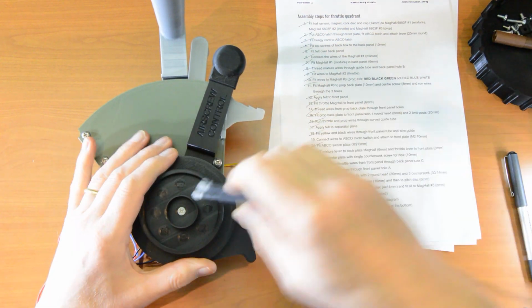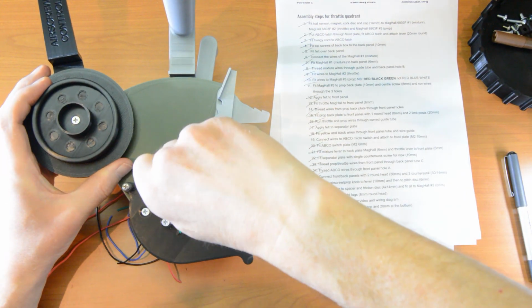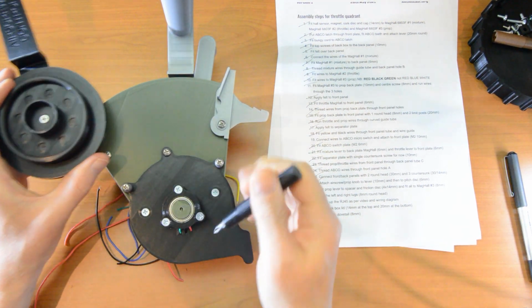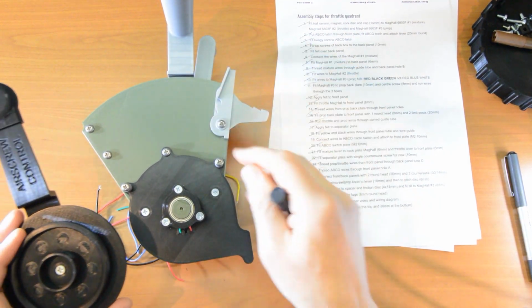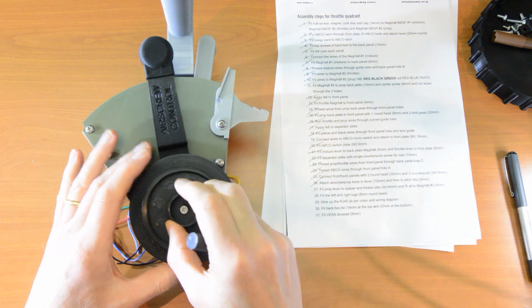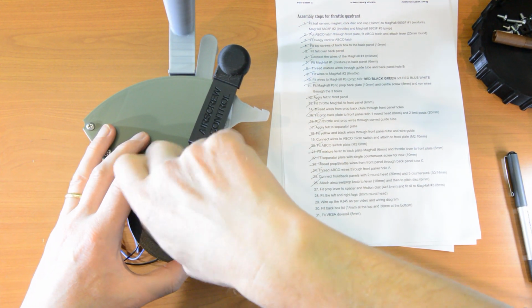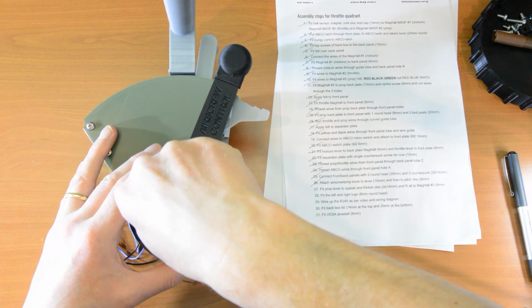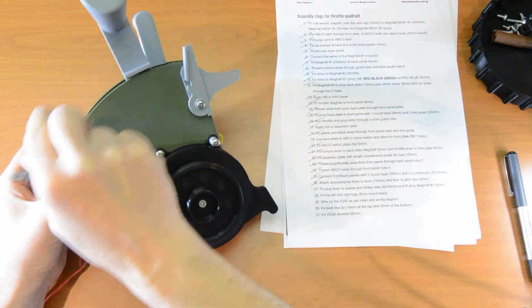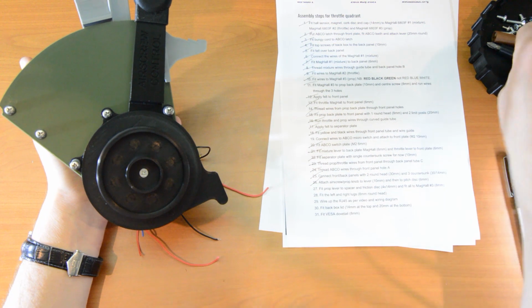Now I think I could use a little more friction there, so let me take it off and just nip these up a bit more. There's no felt which gives extra friction to these levers, so the friction is all down to the cork disc pressure, so that's why you need to just tweak that to get the right friction. Okay, let me try it now. Yes, much better. Much better. Okay, so that's the air screw lever. Nearly there.